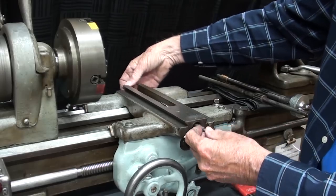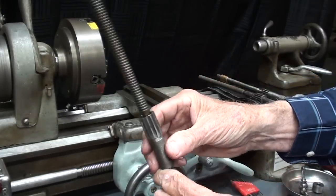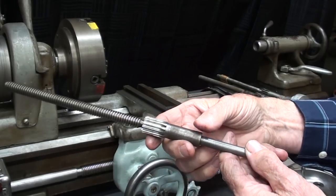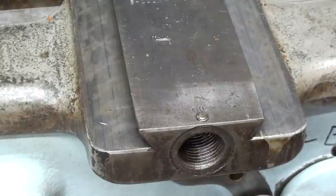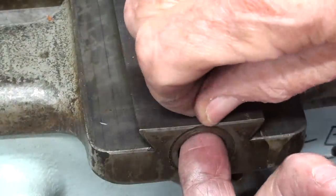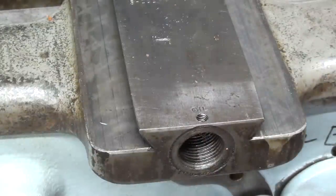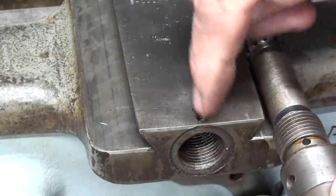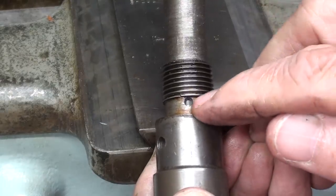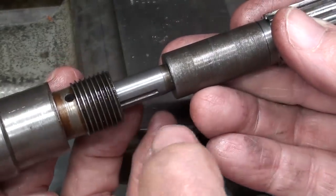Remember, I had to open up this hole a little. Here is the one that I modified — cut the gear and installed it in an earlier video that you can look at if you desire. Maybe I'll try to put the link down in the description. There's a little screw here marked 'oil.' I've already moved that out — it has to be flush. The purpose of that is so when the screw is installed, you can put a few drops of oil in there, and that oil should go through that hole to lubricate the shaft right where my thumb is.